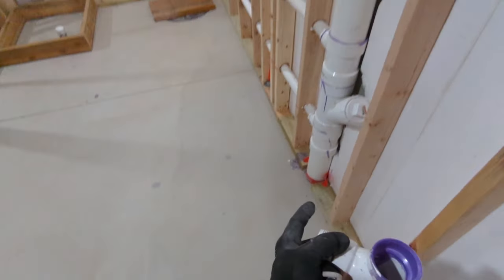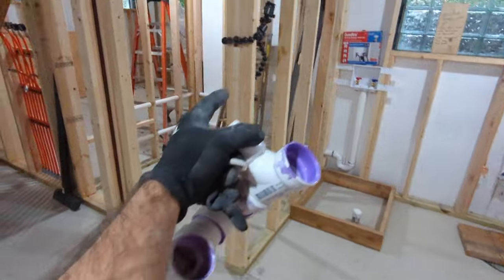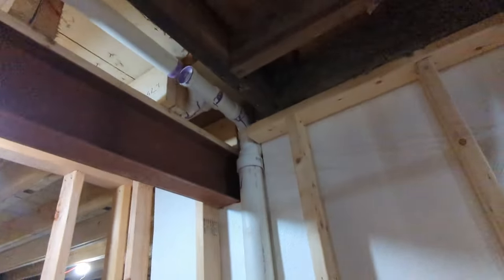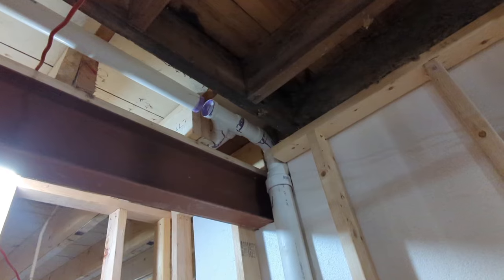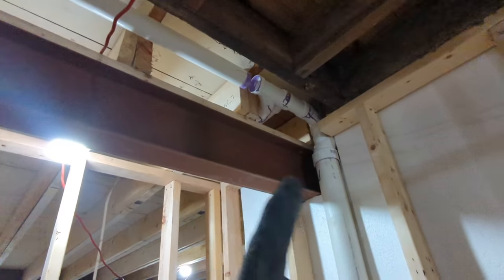And then we could zoom back up and get atmospheric pressure from the top of the house all the way back up and around and up there to chase that sink down. I think that there's a chance he might pinch me on that not being legitimate as far as code. It'll certainly help that sink to flow better than the sink used to flow.